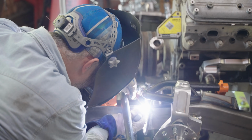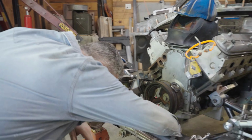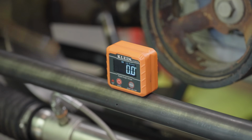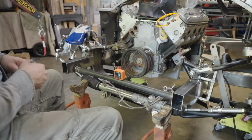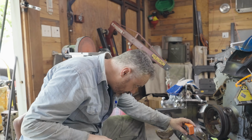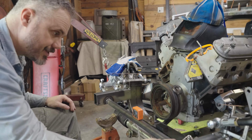It just gives us something to work against. Let's see how this does. All right, zeroed. 1/10 of a degree. Whoa, 0? I usually regard 1/10 of a degree as within the error range for these cheap little gauges, so I'm usually happy. But I'm always happy at a 1/10. I think that a 1/10 is functionally 0. Based on if I'm tilted forward, okay, I'm not necessarily gonna chase that, but I am gonna note that it thinks this side is just the smidgiest higher.